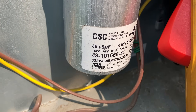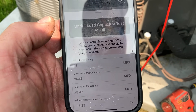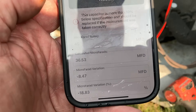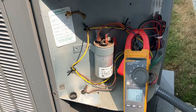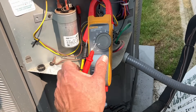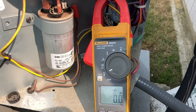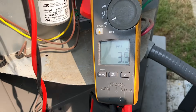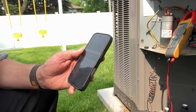So 377.7 volts. This capacitor is rated 45 over 5. Let's calculate — the capacitor is more than 10% below specification and should be replaced: we're reading 36.53 microfarads. If you ain't testing, you're guessing. Let's check those numbers one more time — amperage 5.2, voltage 377.5 — I got that reading right before the thermostat satisfied and turned off the outdoor condensing unit. Calculated again, still more than 10% below specification.